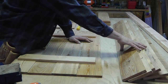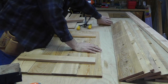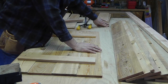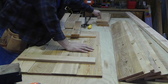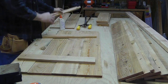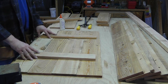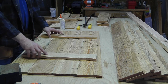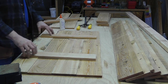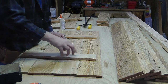These last remaining six pieces all had to be cut at four foot, which gave me two-foot pieces left over. I took two of those scraps, ripped them down the center on the table saw, and cut them to 20 inches — those will be my braces. Even though this wood is waterlogged, having it in the garage for a few days should dry it out. I'm going to clamp these to make them straight, then glue and screw the braces on, then let it dry for an hour or two.